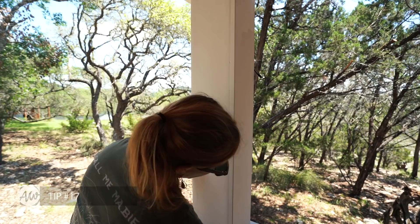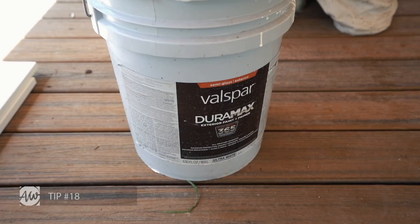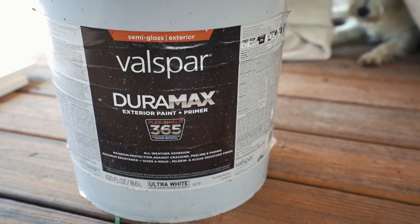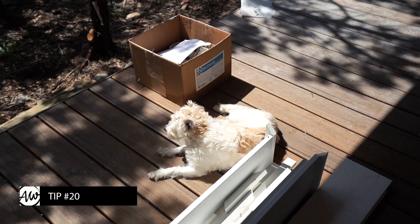If the prime coat is a little rough when dry, give it a quick sanding before you paint. A quick wipe with sandpaper and a scrap block is all it takes to get rid of nubs and whiskers. Scraping paint is one of the worst jobs on earth, so choosing paint that will last is worth some extra time and money. Aside from long-term durability, you'll get better coverage and less fading over time. I don't want to repaint anytime soon, so I chose Valspar Duramax paint. If you're in a hurry to cover large areas, roll and back brush — a roller is the fastest way to get paint on surfaces, but a brush is smoother. By tag teaming it you get both. One person can do it, or it works great if you have a helper.